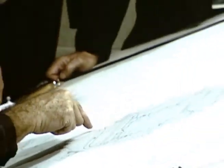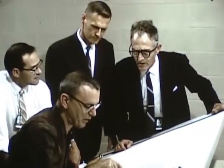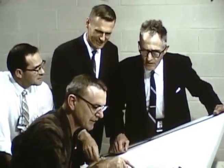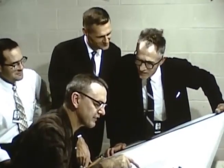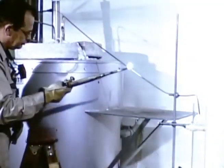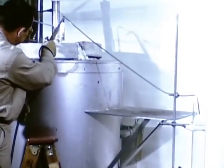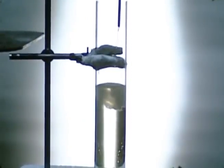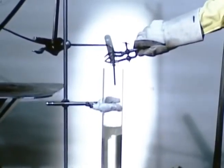Preliminary design of the reactor began in May 1960. Technology developed by the earlier Aircraft Nuclear Propulsion Program at the laboratory was used as a basis for designing the MSRE. The molten salt fuel for this reactor is radically different from that used in solid fuel reactors. Salt flows from a pipe which is heated to keep the salt molten. At 1200 degrees Fahrenheit, the salt does not react with air — it flows like water but does not boil.